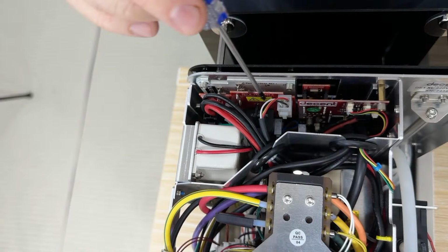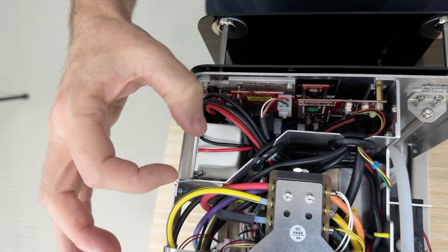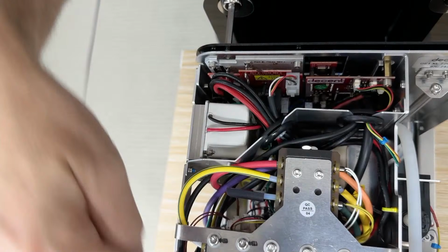And what that actually is doing is that's the same as an electrician's clamp. Have you ever seen them put a clamp around your electrical wiring? That allows them to measure the current that's going through a wire. And we do that right there for a very clever reason, which is we're able to measure the load that each component is using inside the machine.